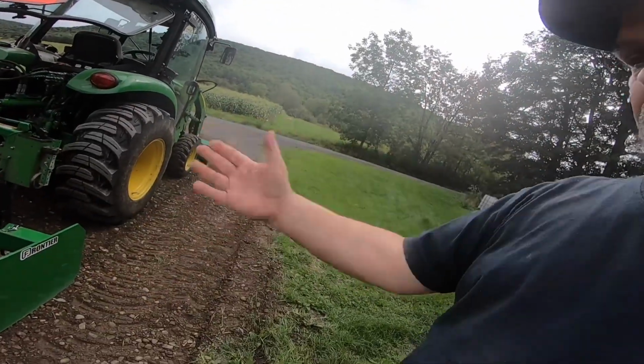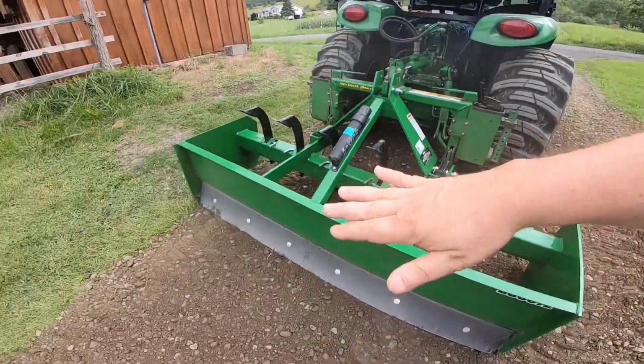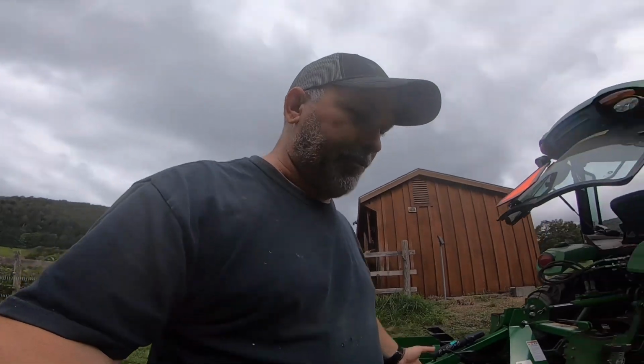Again, just a short video. I just wanted to show you what I meant about running the box blade level and just driving around with a box blade full of material. You're really not accomplishing as much as you think you are. You have to allow the material time to redistribute itself. And if you're just driving around with a full box blade, you're not really doing that, and you're not accomplishing much other than seat time in the tractor.